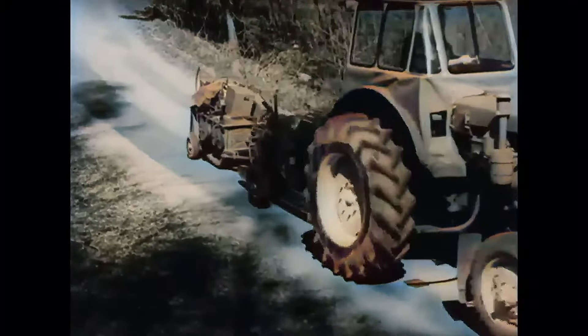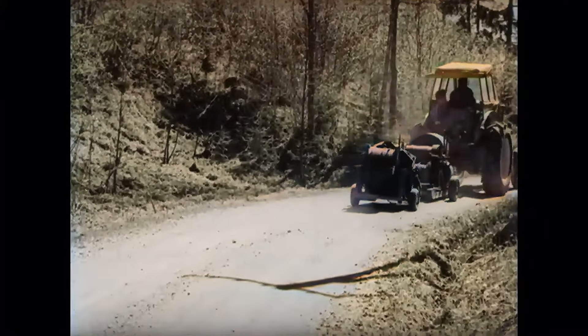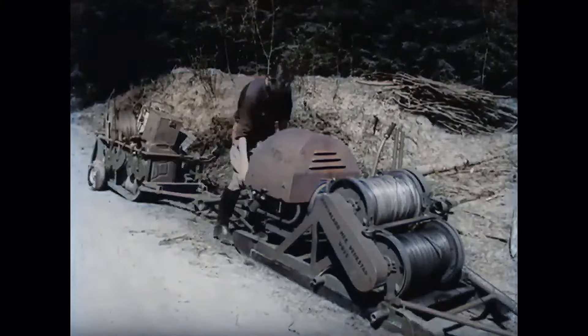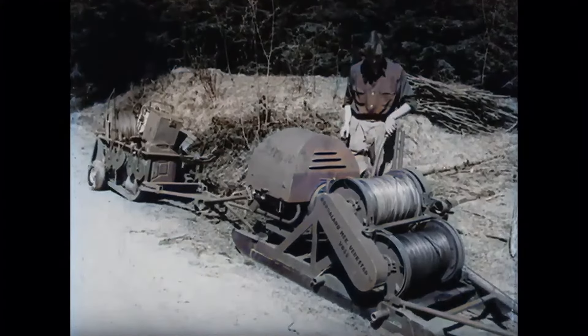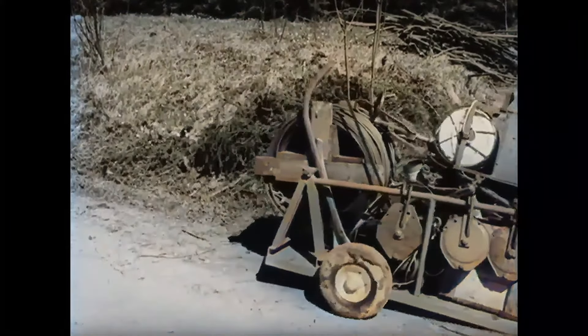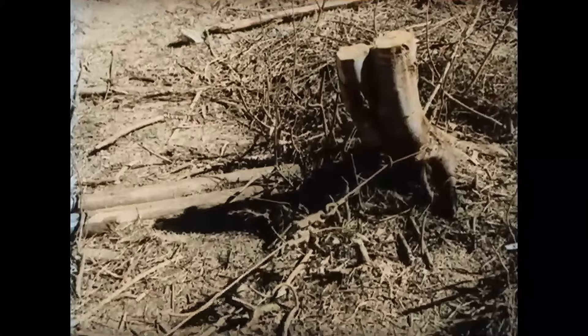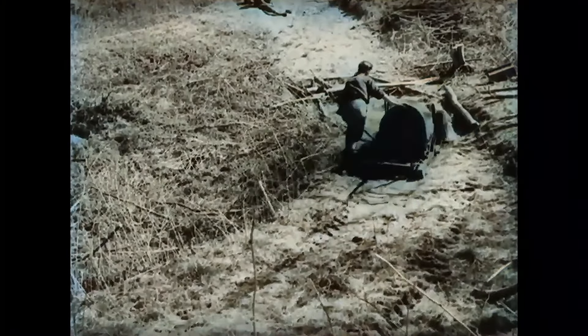We are finished on one field and shall move to a new one. If the distance is long and the road good enough, it is an advantage to use, for example, a horse or tractor for transport. But off the road and over shorter distances, the winch propels itself forward under its own power, pulling a winch trailer where all the equipment has its place. The haul line can be fastened to a tree or a stump, and in this way we haul ourselves forward from tree to tree. The trailer is pulled along afterward.